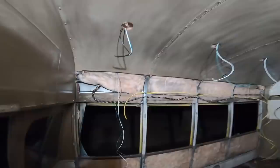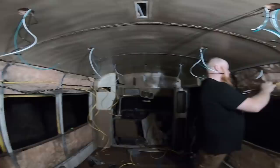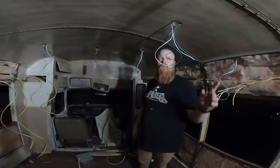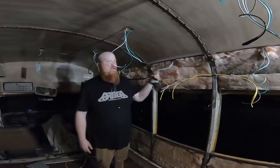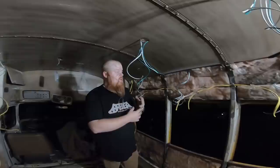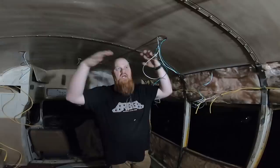And we're finally making progress for today. Lots of wires everywhere. We still gotta pull one wire through the ceiling. We need to do it back there or back here, but basically this is our main wire for all of our lights. These lights are only 12 volt and I'm using 16 gauge from the Romex to the flush mount little canister lights. Like I said, they're only going to pull 12 volt, so it's going to be perfectly fine to do 16 gauge wire from the Romex. But I got the Romex because it can carry enough load to power all these lights. Then all these lights are daisy chained, like I said, with 16 gauge. So that's what this wire is running down through here, to daisy chain to all the lights.